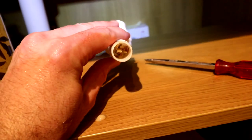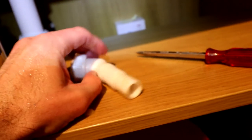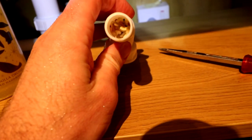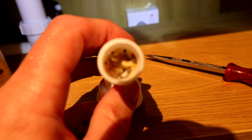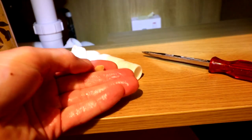I checked underneath — there are the pipes, you can just about see them going under there. Eventually I found it was blocked at this end, even though it was making very peculiar noises at the pump end — so I thought something was rammed in the pump, but it was actually further along. The dishwasher outlet goes into the T-piece there, and look — some bits. I don't know how they got past the filter, because that's supposed to stop all that sort of stuff. It's peanuts.